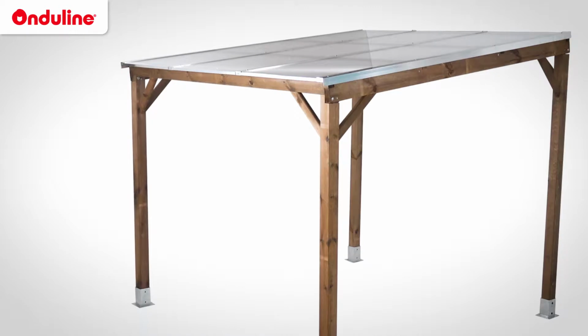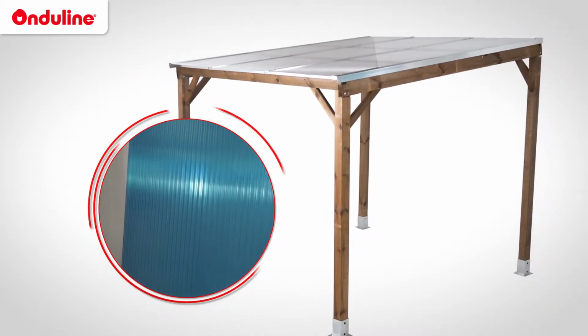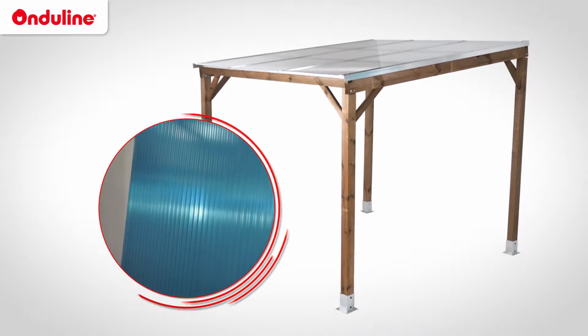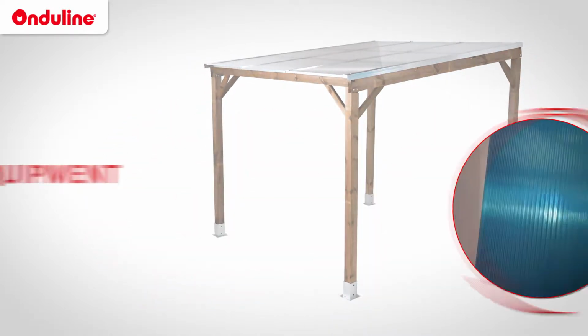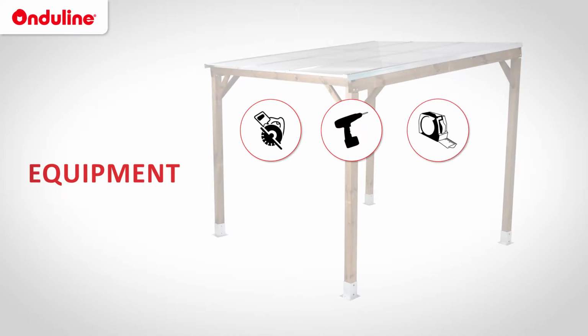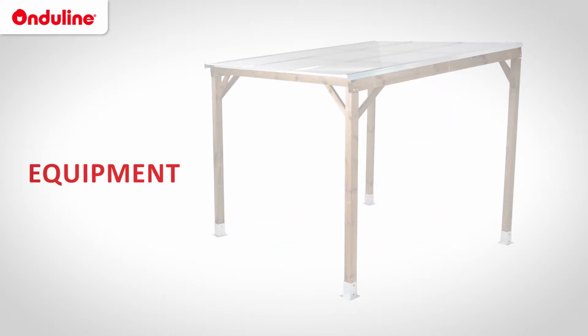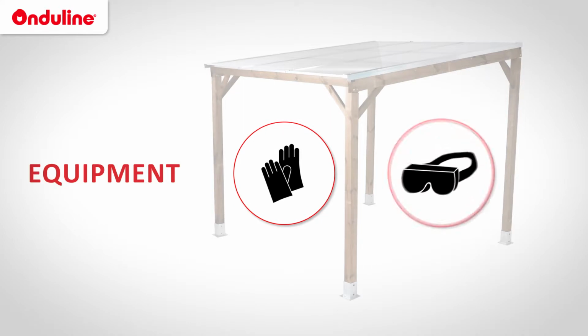We will show you how to install your Onduclair PCMW, a polycarbonate multi-wall roof light, in a few easy steps. You will need the following equipment: an electric saw, a screwdriver, a measuring tape, a pen, a spirit level, and a set square. Personal safety in a work environment is important. We recommend to wear gloves and safety glasses and work on a stable support.